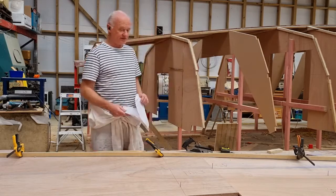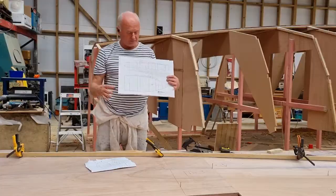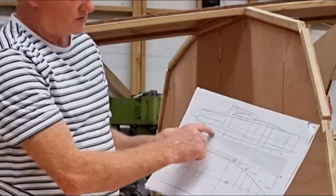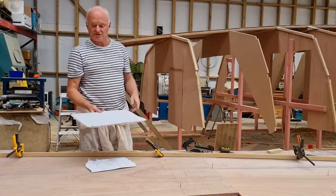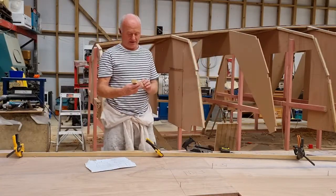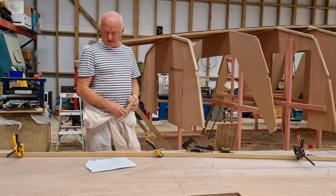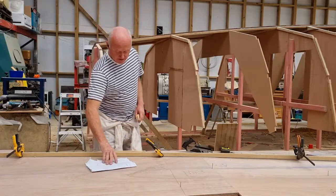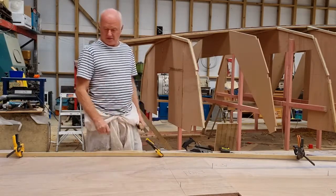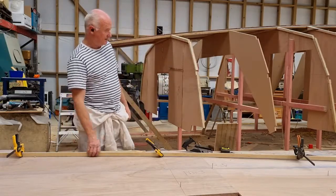At the stations themselves, you can't take the station off the lofting plan because the lofting plan is done at a level, whereas we're doing a curve so there's more distance to travel. You've really just got to climb up there and measure it on the job. Mark it down on a piece of wood for each station as you go for each sheet, scribe them across, and then take the measurement off your bulkhead plan for the bottom of the boat. Put a nail at each point and clamp up the batten.